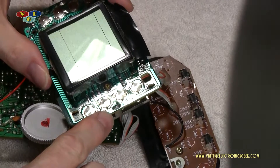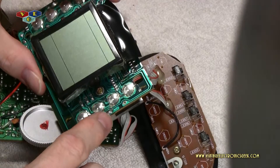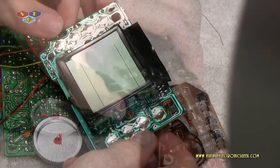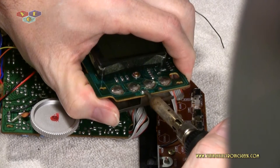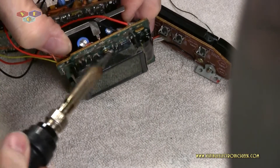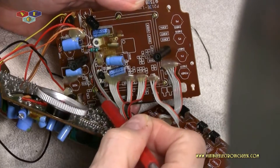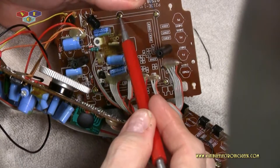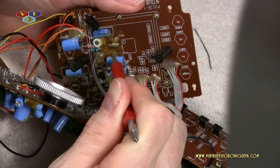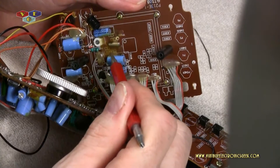Since this is a little bit thicker solder, I currently have my soldering iron set to 500 degrees. I'm going to increase that to 700 to pop that off quickly. I've got this point here and this point — that's all I have, just those two points. Up underneath that cover we have four screws that need to come out, also size PH-1. There are five caps underneath here and they're all embedded with hot glue, so I may or may not replace those but I will check their values, and if they are out I'll go ahead and remove them.